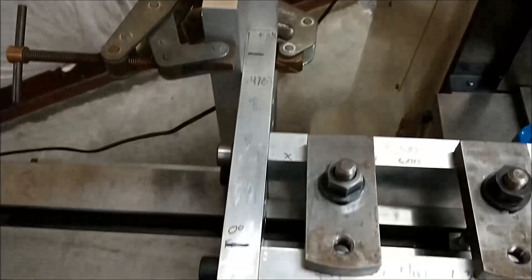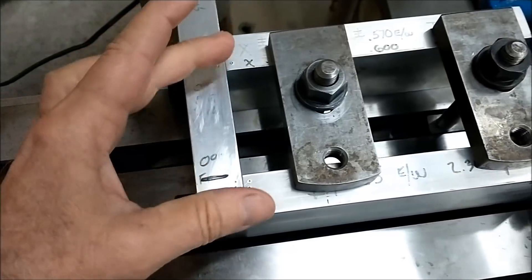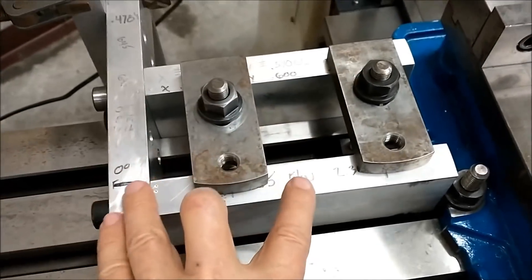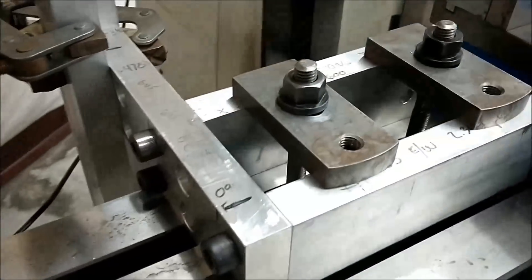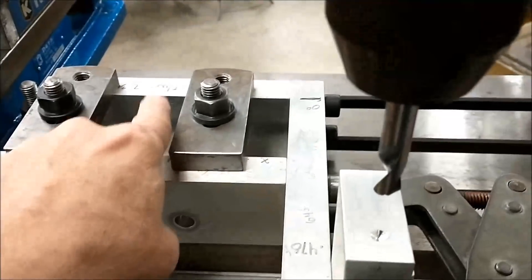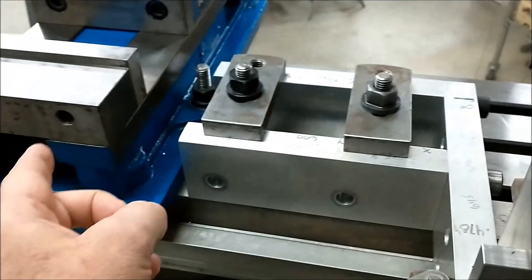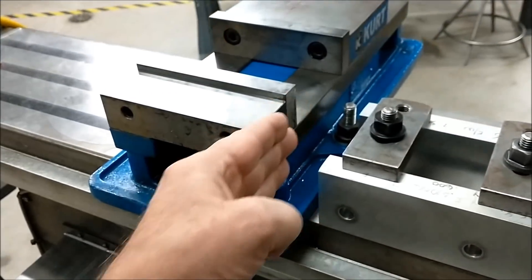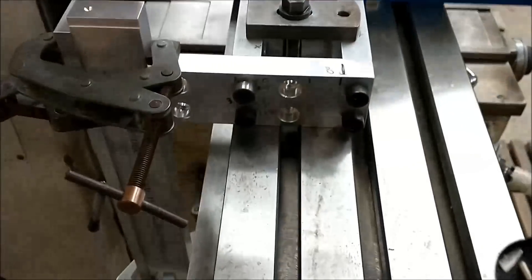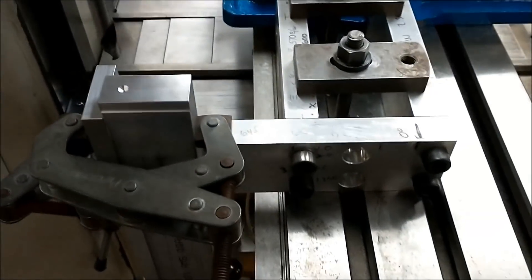This is 1x2 6061 aluminum bolted from the ends to form this particular inverted F-shape. The reason it looks like this is because for quick setups I squeeze this part in the vise, and this back piece has holes so as the vise bites on, this piece slides over the back jaw and secures there as well, projecting out. The drop bar allows for stops to be set and pins to be added — there's a pin here for some of my longer pieces.